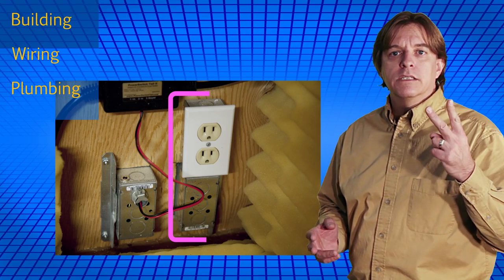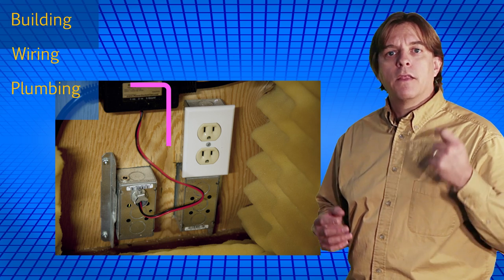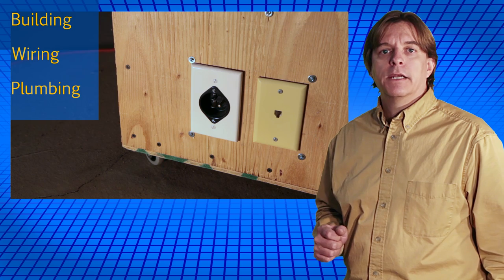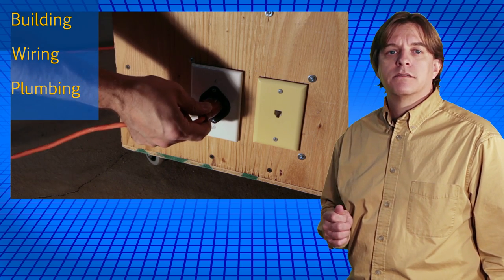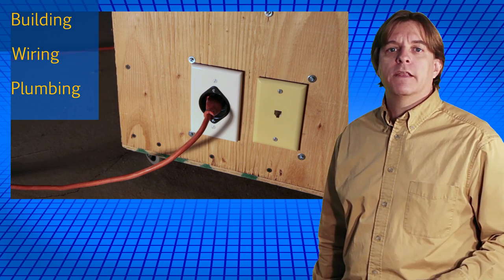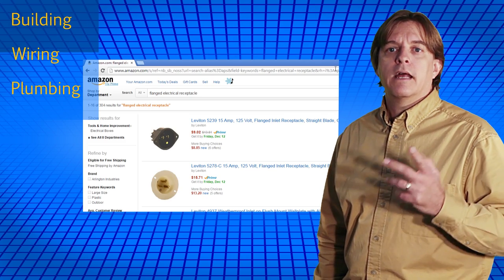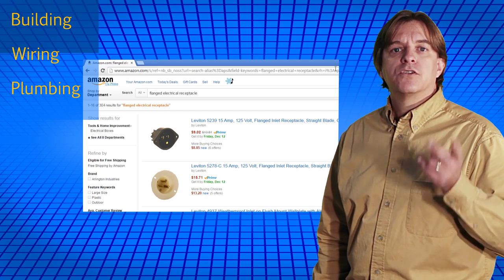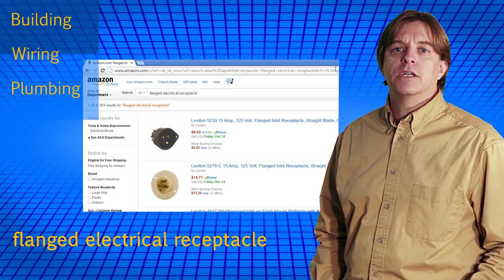The electrical part has two components: a line voltage side and a low voltage side. On the line voltage side, one of the boxes pointing to the outside has a male plug on it. This allows me to plug an extension cord into the box. This type of plug is convenient to use on projects like this, but I couldn't find one at the normal places I typically get electrical parts — I ended up having to order it online. If you're looking for something like this, search for flanged inlet receptacle. There's also an Amazon associate link in the description.